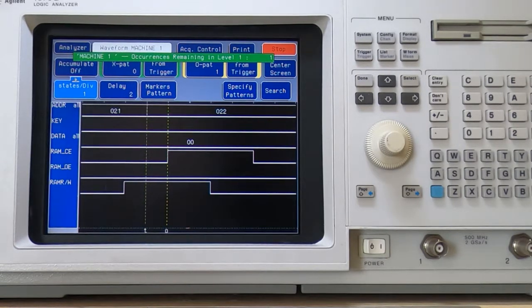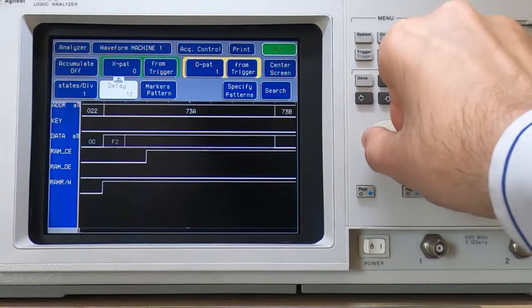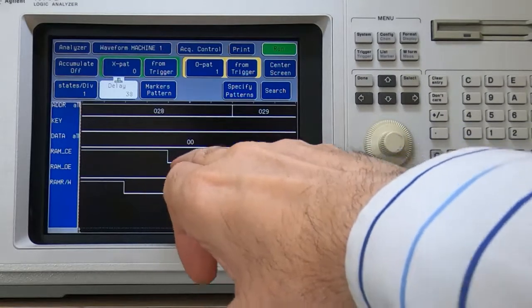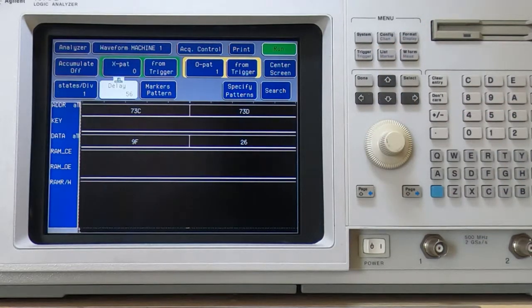Looking at the waveform, I was setting the trigger such that when I entered the password entry function I was triggering the analyzer. I'll just enter that now - going into the password entry screen on the punch. As you can see, that's allowed me to capture that particular event. The analyzer is also monitoring the RAM chip select lines, so whenever that line goes low I know it's reading a value from the RAM. I could see what values it was reading in response to entering the password, thinking that at some point it would read the values from RAM that constitute the passcode. Unfortunately, that's not how it seems to work - I spent several hours doing this and didn't get any closer to a solution.